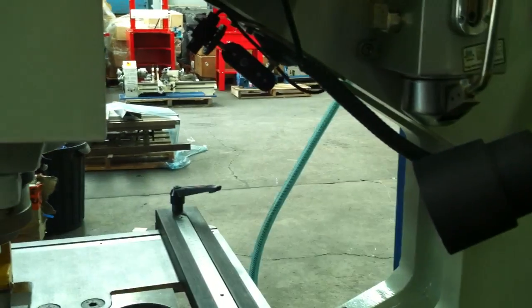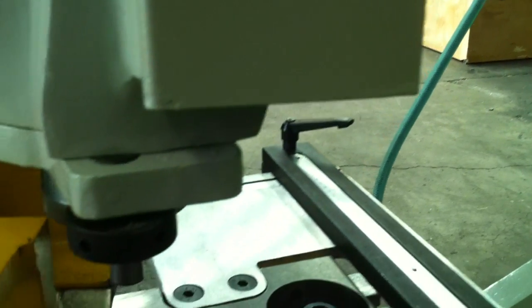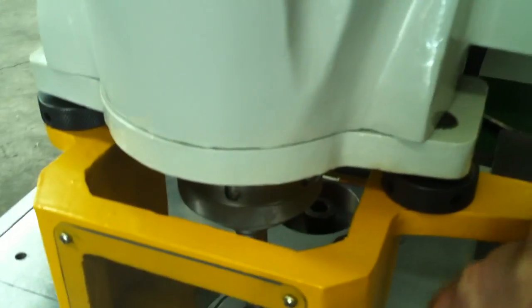Also on our new PS70, we've got a laser line, which as you can see is mounted on the punching station and gives you crosshairs on your punching — easy to align your centres for your holes when you punch up.